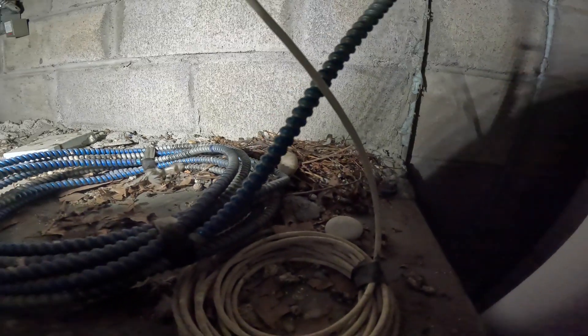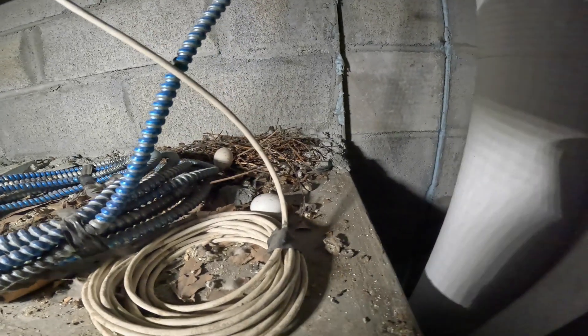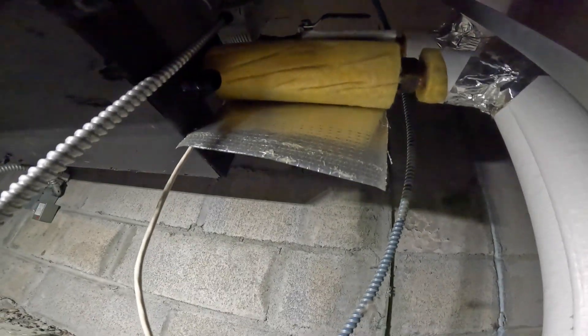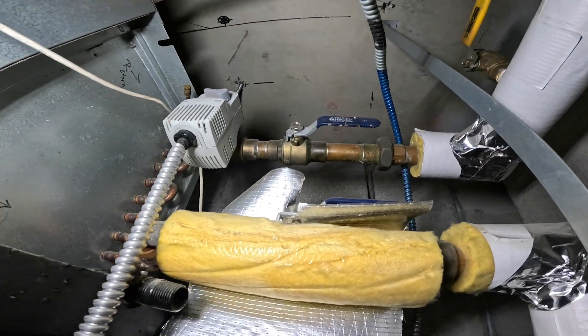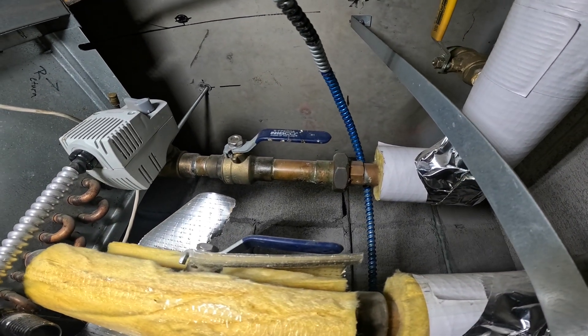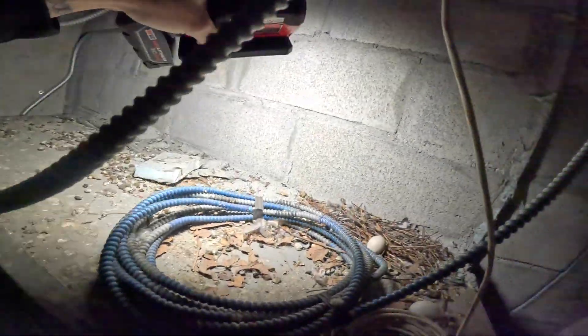Where's the bird? This thing wasn't working — it would have kept these guys warm. You got two pipes coming in. That's the valve actuator. I feel hot air, so I know that valve actuator opened and I heard it too. It's a Siemens actuator. I feel hot air coming out of here, and this is where they were hanging out. It's freaking disgusting in here, and sad at the same time.